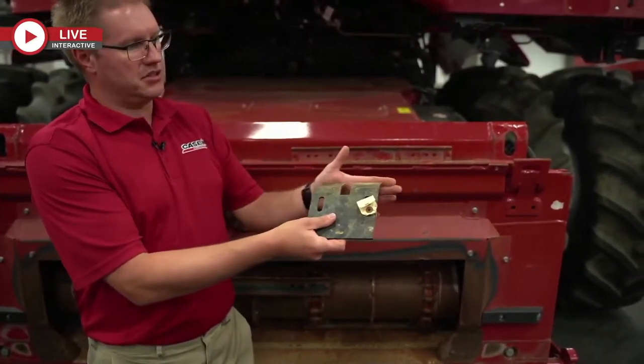I was going to show you this moisture bypass unit. The auger is actually still full of grain. If you do see material in this, Louie was talking earlier about the little 5-amp fuse on the harness — it's right back here. Inside this assembly there is a proximity sensor that senses when the grain is full, and it will turn on the auger to take the old material back to the elevator and let new material in. That sensor, depending on the age of the combine, can get a little less sensitive. In wheat, barley, and higher-moisture canola it'll work fine, but in really dry canola around 5-6%, it'll stop working. There is an adjustment procedure the service department can do to make that sensor work properly again — not something I recommend people doing themselves unless they know exactly what they're doing.